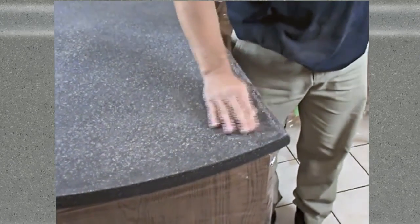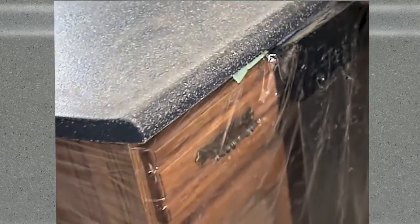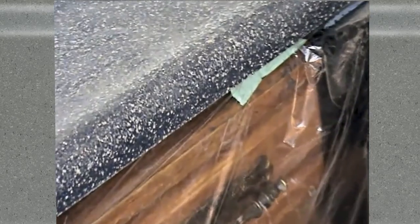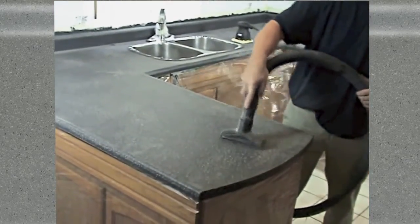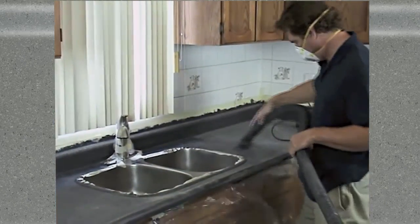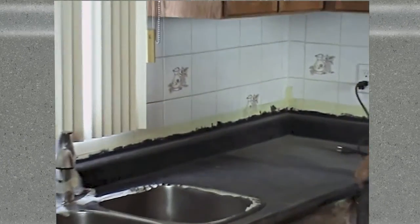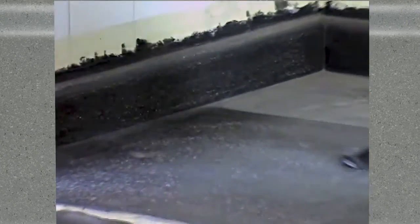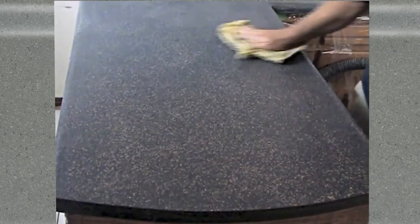As you move along, right after smoothing a section of the surface with the rougher 80 grit sandpaper, switch to the softer 120 grit to give the surface a final polish. When sanding is complete, all surface dust should be thoroughly removed with a vacuum, and then wiped down with a damp cloth to remove all dust. If a vacuum is not available, careful sweeping should be employed. The goal is to ensure that no dust is left behind to cloud the finish when the clear topcoat is applied.